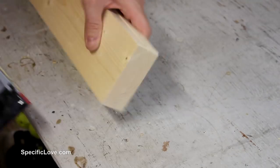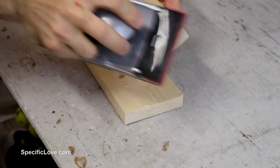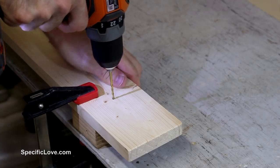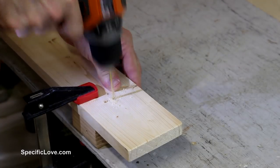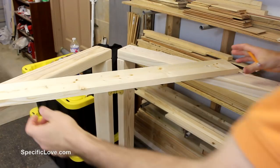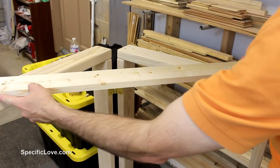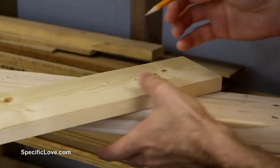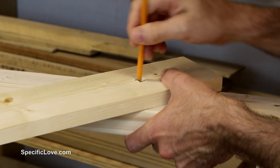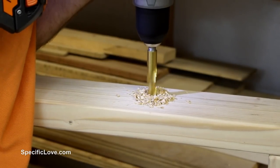Moving back to the top sign boards, I used a hand sander to gently remove all the sharp edges on the ends. I then chose the board which would be the base and clamped it to my bench. I then made a mark at the center of the board at about 4 inches from the end. Using a two-step drilling process, I made a half inch hole on each end. I then aligned the board with the top of the open frame, with the front corner of the signed base even with the outer edge on both sides. I then made two marks on the frame through the holes and again used a two-step drilling process to make a half inch hole in both frames.